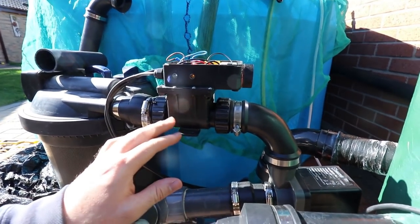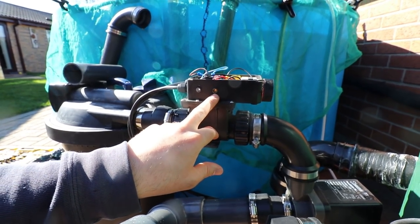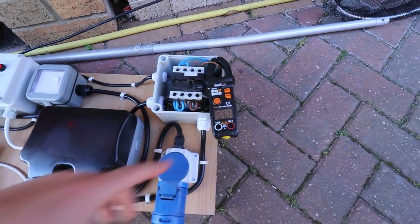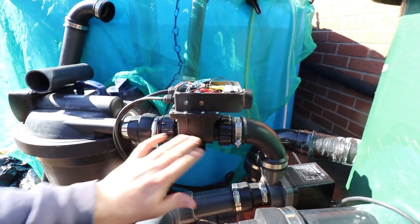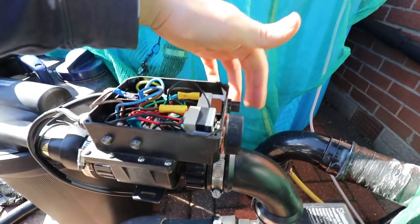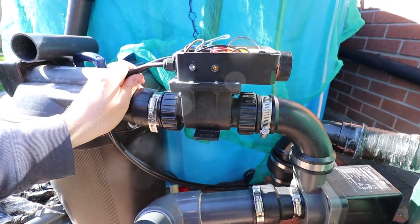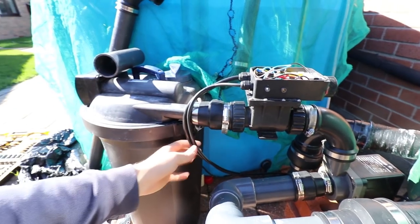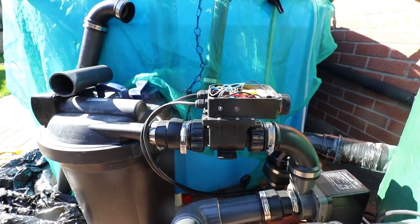This is how I've wired the heater. There are still two indicator lights - one always on for power, one on when the thermostat is active. If I turn the thermostat on the heater down, that light goes off and the amperage drops right down. I've turned it back up to maximum so that if the water temperature ever hit 40 degrees due to a fault it would cut out. There's also a 60-degree thermal cutout as a second safety. The thick cable is power in and the thin cable is just a signal for the flow switch - no mains power on that one.